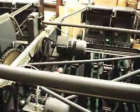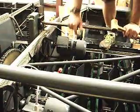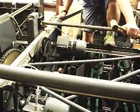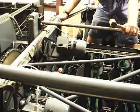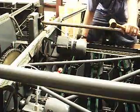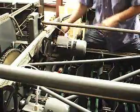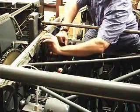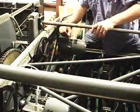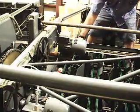I'm going to get back here on the pin setter itself. I'm going to straddle the shark — I have no body weight on the shark. My feet are resting on what would be the impact strip support that goes across the back, about a three inch pipe. I'm going to lean my thighs into the side frame here and push towards you on this motor to take tension, making sure this is lowered all the way, and remove this belt. It is bottomed out. Set screw's still in it — that's a good sign. At least I don't have to go find a set screw.